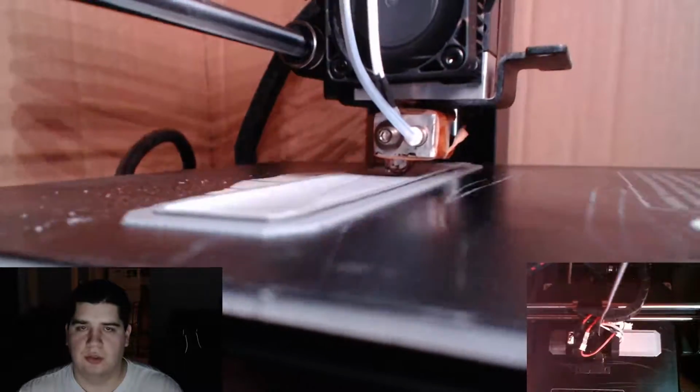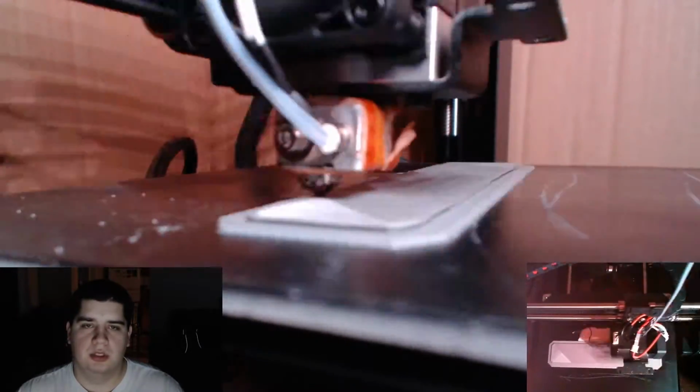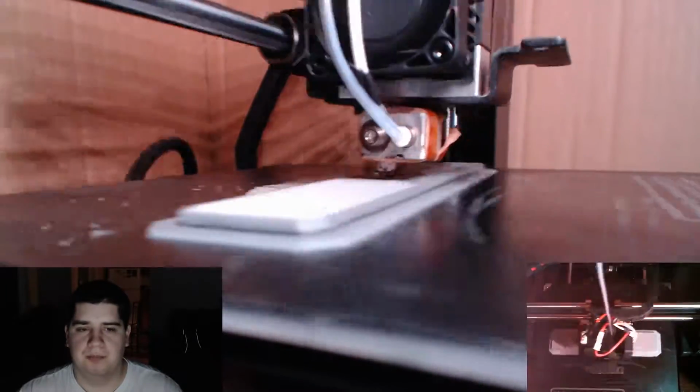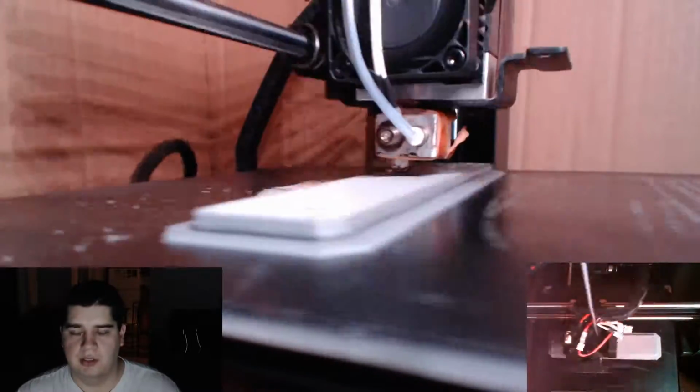Once all the parts were printed, I just painted them and glued them all together. The base did have to be printed twice, because the first time the holes in the base were too small. In Blender I upscaled the holes in the base by about 20% over what they were before. All the pieces took in total about 8 to 9 hours to print.